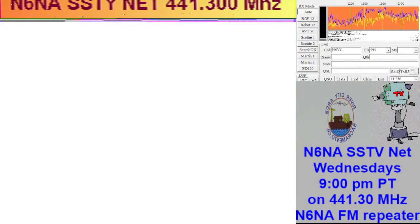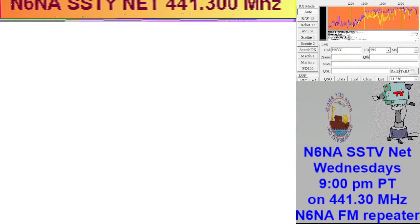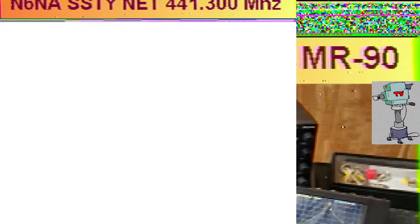So it's got some rejection in the 2 meter band, which is what you want. And yeah, there's a couple of HP attenuators. I don't normally like using those in test bench setups. Those are my calibration standards that I use for checking others. But I don't have any SMA attenuators. At least I don't have any that high.